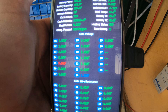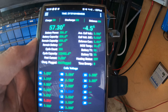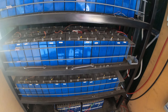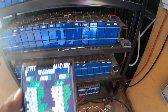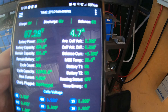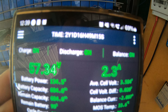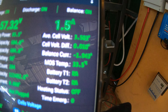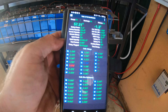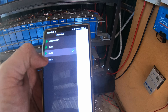0.5 — that's not bad. You're going to see the most cell difference at the very top of charging and the very bottom. The cell with the highest internal resistance is probably going to lag behind and need the most current, but it's not going to get any more current than any other cell, so you expect it to lag — which is what we're seeing. This is shelf two: it's been on for two years, one day, 16 hours, and it's got a cell voltage difference of 0.018 volts.